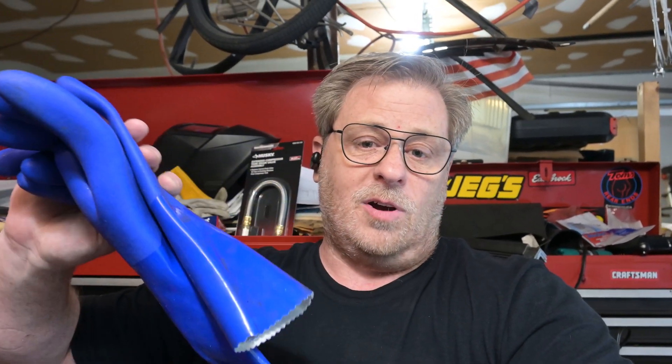I have to take a couple of seconds here to point out a safety hazard I should have mentioned. You saw me dropping the hardware into the muriatic acid with my bare hands — that is a hazard. Muriatic acid is hydrochloric acid. It will burn you, it will burn skin, it will severely damage your eyes. You need to be wearing proper safety equipment when handling it. I have heavy rubber gloves that I use when taking parts out and cleaning them, but I should have also been wearing them when putting parts in, because the washers and bolts were splashing a little bit. Please, if you're using this stuff, be sure to wear all the proper safety gear and follow all the directions and precautions on the label.